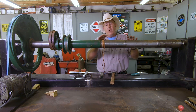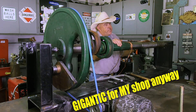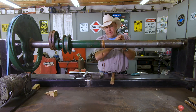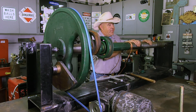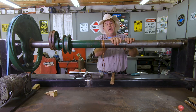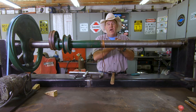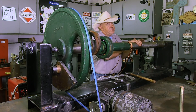Another challenge with this shaft is thermal mass — this is a gigantic piece of steel. If we just start welding, we create several problems. This thing is cold on both sides and we'll create a quenching effect between the cold metal and the hot metal. We don't know what alloy this shaft actually is — it machines kind of like 1018, but there's no way of knowing from back then. If there's carbon content in here, the last thing we want is for it to quench. It will quench because the shaft is cold, the weld is hot, and the heat gets drawn away really fast — which can cause embrittlement between the unwelded and welded areas. To help prevent that, we're going to warm this piece up slowly using a rosebud.